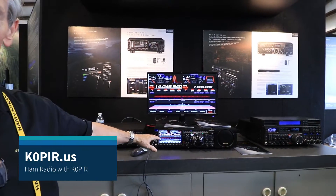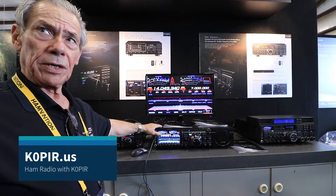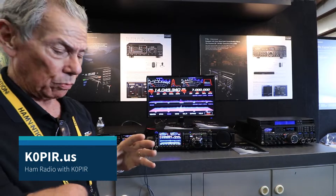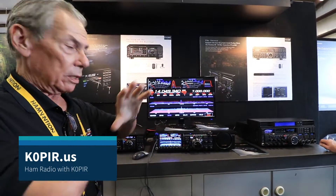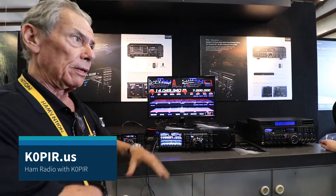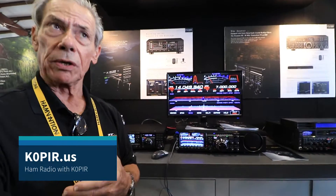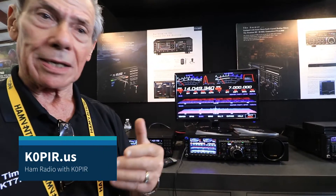Our new SDR isn't just another pretty case. Anybody can do SDR, but what we have is a hybrid SDR. Why a hybrid? Because the problem with normal SDR — which is just a direct sampling SDR — is it samples everything coming in the front door: the artifacts as well as the signal you want. Then you have to have an A-to-D processor that can handle that much work, and unfortunately processors are not at that state yet where one can handle it all.